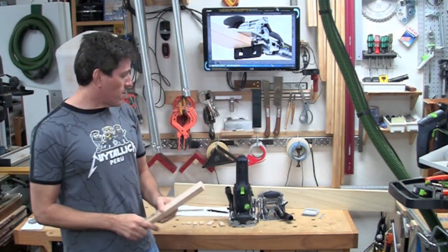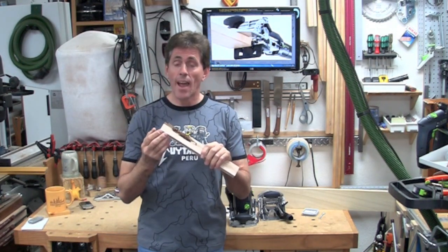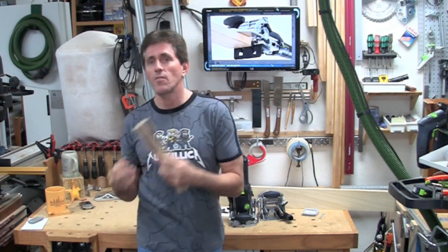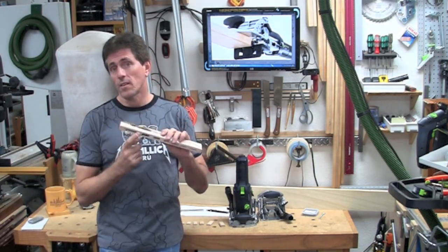But if you use some simple techniques that I'll be showing you here, you can create a mortise that's this wide, and it's very repeatable. You can place this larger mortise accurately with just a single pencil line for the center, so it makes it very convenient — just using a couple extra techniques with your DF-500, you can make repeatable oversized mortises like this.